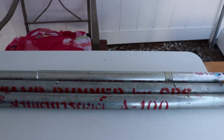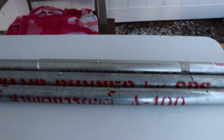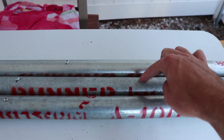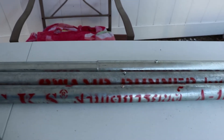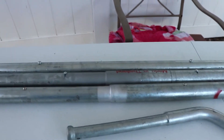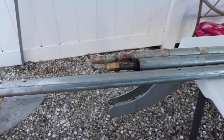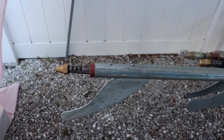The CKS is closest towards you, SPS is in the middle, and CLP is right here — the Beaver Dam mud motor. CLP at the very top has a brass bushing. SPS has the green bushing, which is medium quality — it's above the Delrin orange bushing but below the Bayou bushing. The Bayou bushing is supposed to be black, so don't get confused with that.